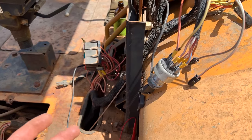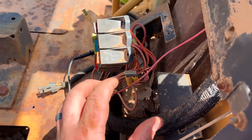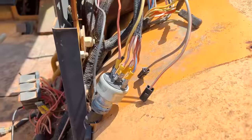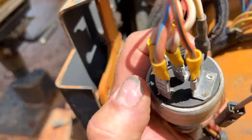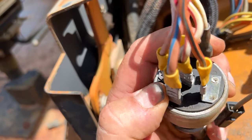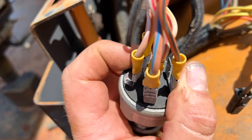All right, let's get you guys caught up. I still need to rebuild our fuse box, because that's not the concern just yet. We want to work through and see what we've got going on with our custom wiring. Now, these key switches are fairly universal, very similar to even what's in Johnny. You have the power in, you have your crank signal out the top. I think there's sometimes a ground built in, and then these should basically have power and accessory, and they don't.